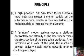The primary applications of LENS fall into three objectives: first, to repair and overhaul components or parts which have been discarded or are currently not in use; second, rapid prototyping or rapid manufacturing; and third, limited-run manufacturing for aerospace, defense, and medical markets. Microscopy studies show that LENS parts are fully dense with no compositional degradation, which is very common in other additive manufacturing parts. Mechanical testing also reveals outstanding fabrication and mechanical properties.